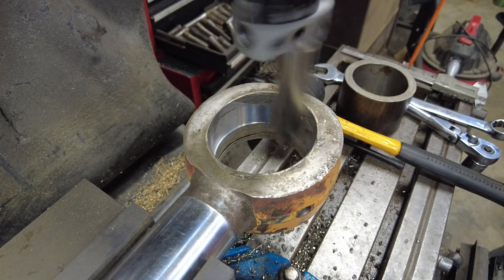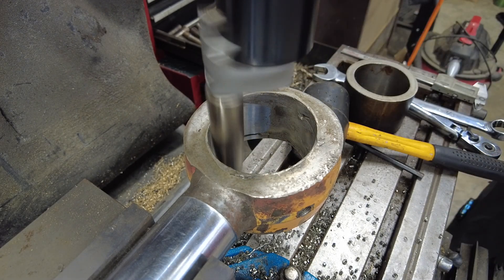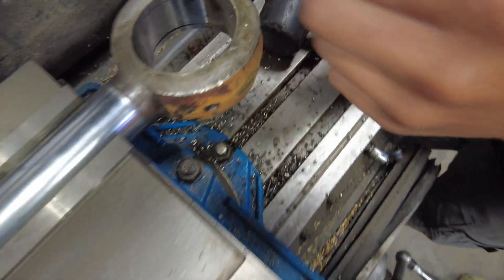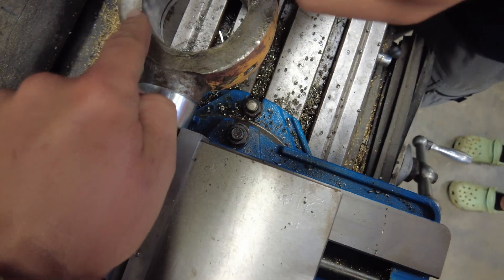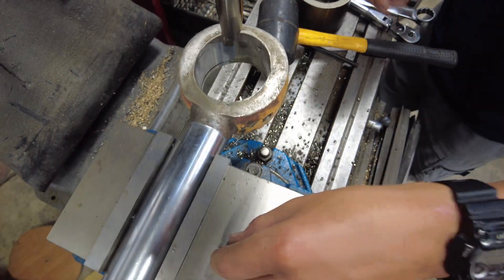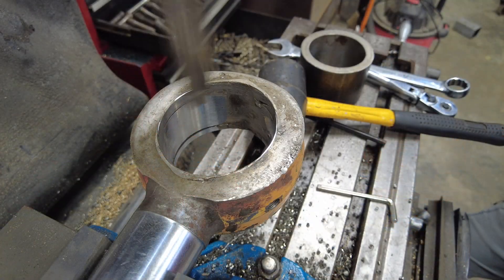Let's engage quill feed. This might take a while. We got the first cut — it cut more on this side than that side, which is probably because I didn't have it perfectly centered. We're going to keep cutting and get this new insert slid in there. I'm just going to work anyway, even if it's not 100% accurate — we're learning.